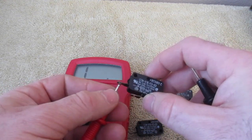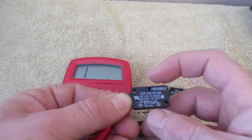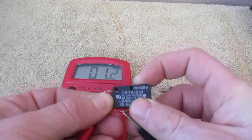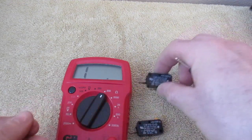So I'm going to test the other one in the same way. It should read nothing at all — nothing should happen. And then when I push this down, you should hear that click, and then you should get a reading somewhere around 1. And this one's reading around 1, so this one is good also.